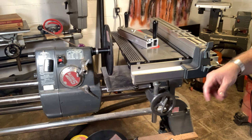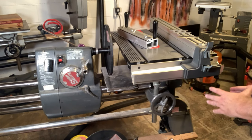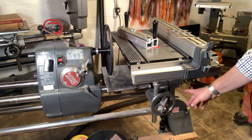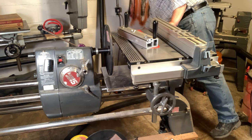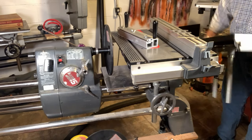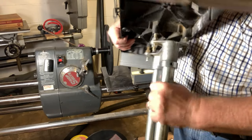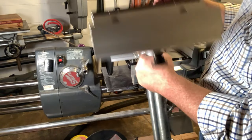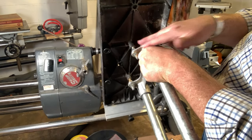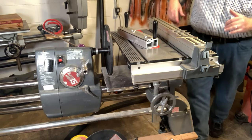We're doing a few things differently than we were doing with the conical sander for wood. I have taken my carriage and slid it all the way over as far as it can go to the right. How far it goes depends on whether you have a lift-assist device or an extension table installed. With my 510 I keep my extension table on, but with the 520 I'm going to leave that table off completely.